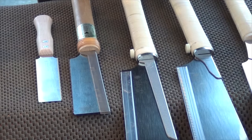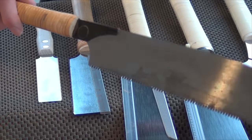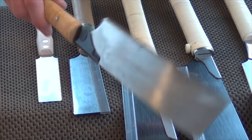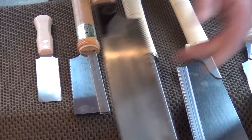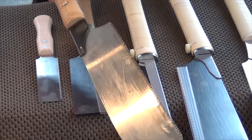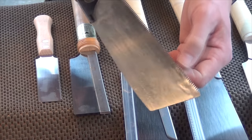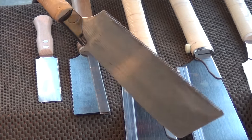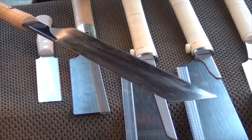Those are my four regular Japanese saws. I also have a Kataba that I started with about fifteen years ago — I bought it specifically because it was the only pull saw around at the time. It's a cross-cut profile. I had some very tough work for it, including hardwood and the possibility of striking nails. I did an awful lot of work on that project and managed to break a tip off one of the teeth. This is something that has been mentioned — that the induction-hardened teeth on Japanese saws can't cope with western hardwoods and exotics, and that they're brittle.